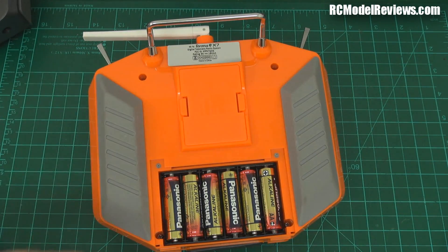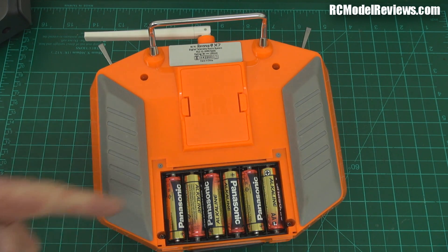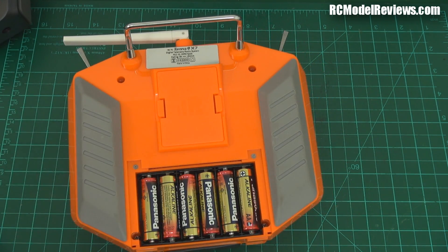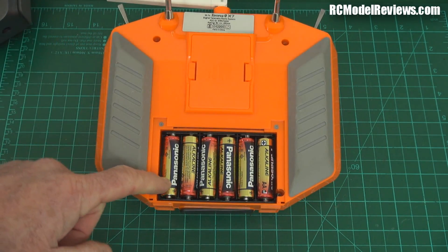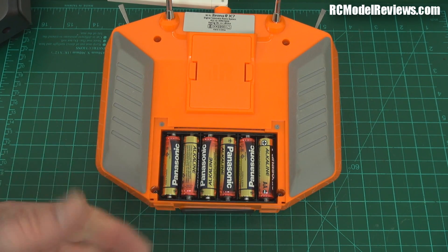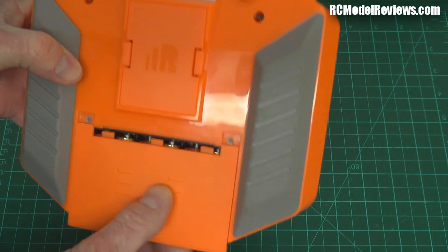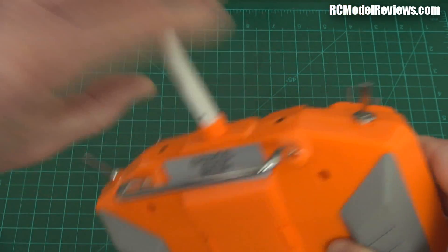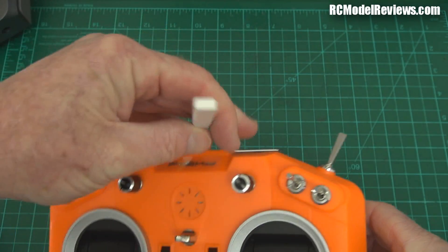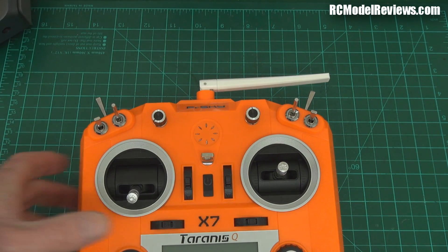One downside: this particular radio wouldn't work when it arrived because the battery holder was giving intermittent contact. These battery holders are the devil's work — do not use them if you can avoid it. Fortunately the battery holder comes out and you can plug in a flat lithium-ion or LiPo pack. Make sure you get one the right size because it's quite thin. I'd highly recommend doing that instead of using alkalines or NiMHs. The antenna is just the usual quarter-wave sleeve dipole which you can adjust. It's white, no problems.